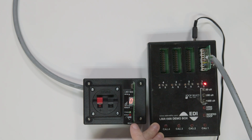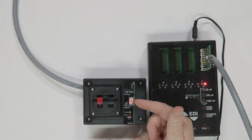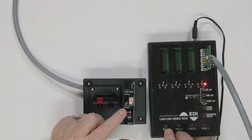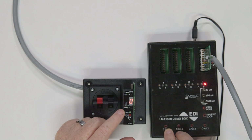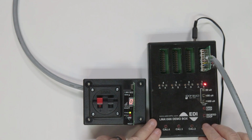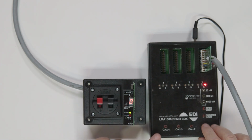If the open or shorted fault condition self-heals, the detect LED and 7-segment display will return to normal operation. The power LED will continue to flash with the sequence, signifying the type of fault that was last detected. In the case of the excessive inductance change fault, the unit will retune to the new inductance after a period of 2 seconds and continue operation. The fault will be indicated by a flash sequence of the loop fault indicator.